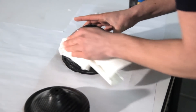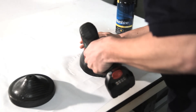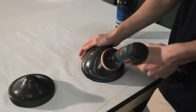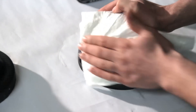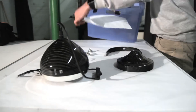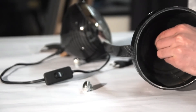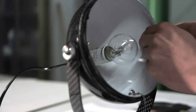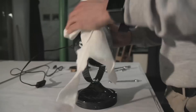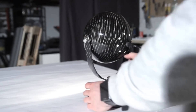This is the last layer of sanding — I did it up to 2000 grit, which is quite high and takes a lot of time. But you're doing it all for results and you'll see the shine popping out of your part if you go high in grit and do a nice polishing job. I started with a coarse grit and went up with fine and smooth polishing compounds to get that high shine I wanted out of these pieces. At the end it's just assembling everything together — my girlfriend did a good job packaging everything up into one box with everything labeled, which makes it easier to reassemble complex parts. I'll just let you enjoy the shots of the finished parts.